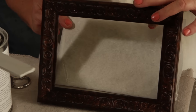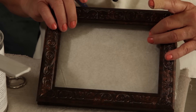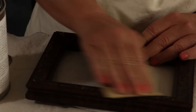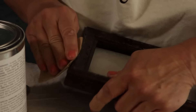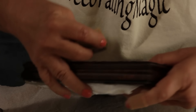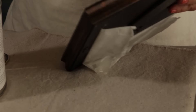Let's get started on the piece I chose to paint. I chose this small picture frame because it has lots of detail, and you'll really be able to see those nooks and crannies once I put the paint and glaze on. I'll wipe it down, hit it with some sandpaper, and apply the first coat. I'm going over the frame with fine grain sandpaper — we're not trying to get down to the finish, just trying to give the piece a little tooth before painting. Be sure to wipe or brush off all that gritty sawdust.